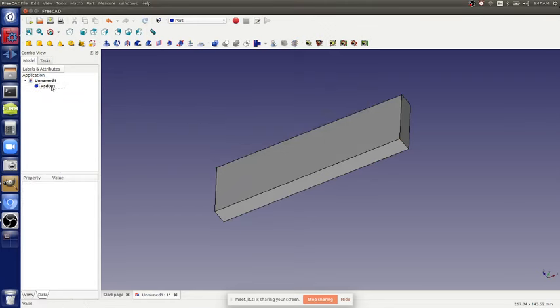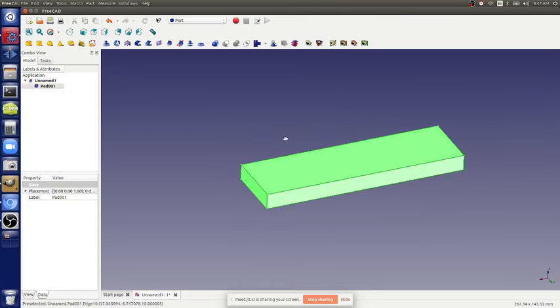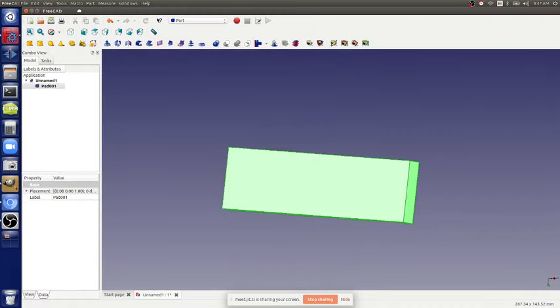So you have that pad. Now I've got this simple solid object. It's got no history. It's going to be less memory. But that's how we work. In the part tree, you want to get rid of all the stuff. And the other reason why FreeCAD 19 is not great for this is we're using FreeCAD 16, because you've got all those plane items within the part tree, which confuse you. It'll be a little harder to extract all of that. You want this very simple object that you cannot get confused.